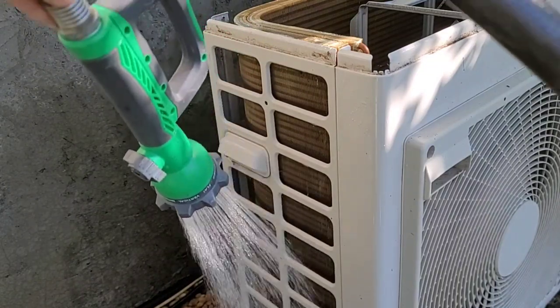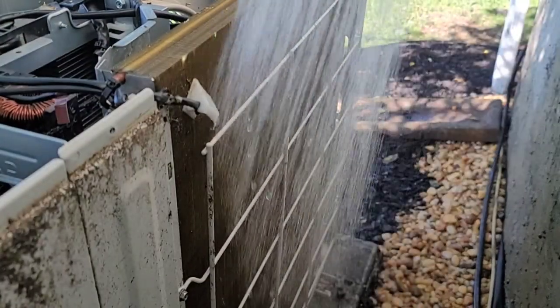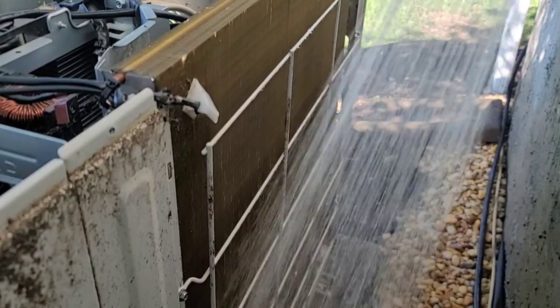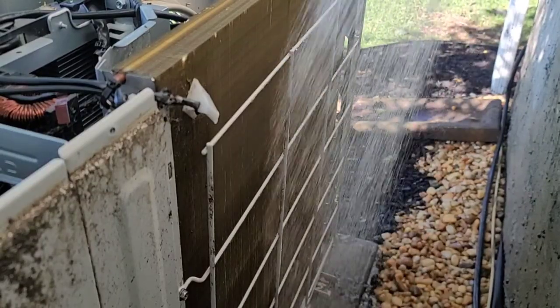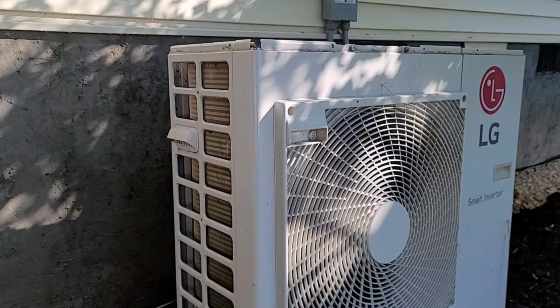Once I've gotten all the way down on the side, I'm going to go to the back. I was most impressed with the back — it came really, really clean. I did take extra time to use the brush to clean out the grates from top to bottom and back. Now I'm just rinsing out the system. Total time was about an hour — shutting off units, pulling power, taking the top off, spraying, letting it sit 20 minutes, then doing a thorough rinse to make sure all the soap and cleaner is out. Now I'm going to let it sit for an hour or two to completely dry out before firing it back up. I'll put the top on during the interim.